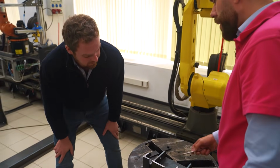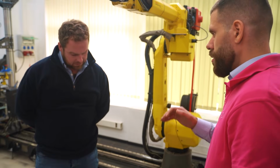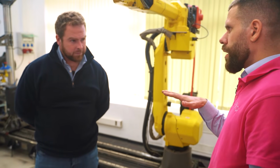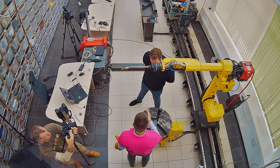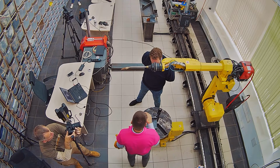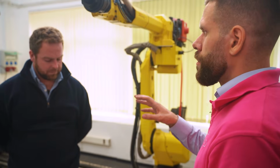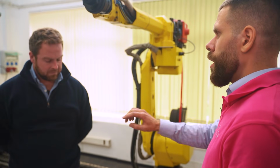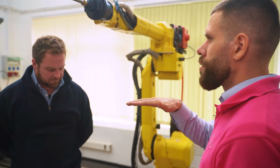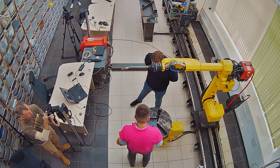With the bad one, we used very straightforward weavings, just from left side to right side without any special staying in the middle of the movement. But with this seam, we used a special thing, where we stayed longer in some position along the weaving. And the weaving itself is not that horizontal. It is different, like a zigzag.